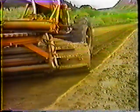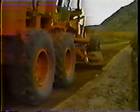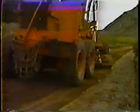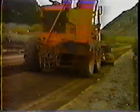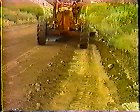Be careful not to change the crown of the road — essentially all you're doing here is smoothing the surface, so no cutting is required at this point. In fact, the blade should be slightly above the surface so that you reduce the size of the windrow with each pass. When done correctly, the final pass should put the trailing edge of the blade along the borrow pit without leaving a windrow.